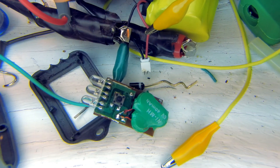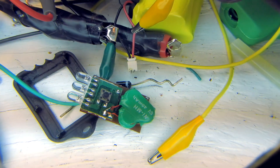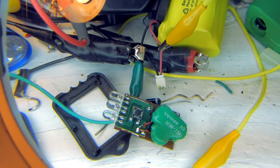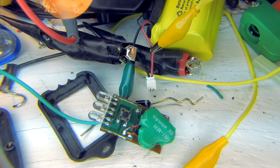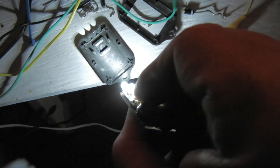So there it is — a little better soldering job. I over-stripped it though; ended up using this kind of stripper. But other than that, it's a nice hot solder job. Other side of the diode: diode, switch, battery, three LEDs in parallel, and of course the solar cell — that's all there really is to it. And look at that — it already works! So that was the problem. It's not even discharged, so I don't have to charge it. It's got the little holes and pins, so it should go back together.